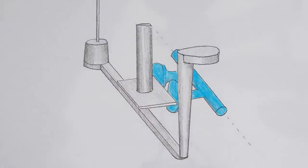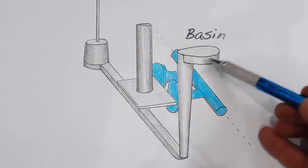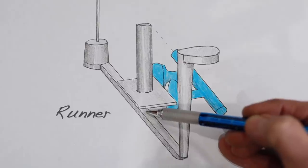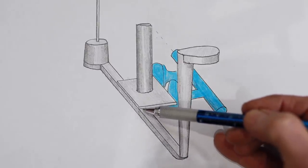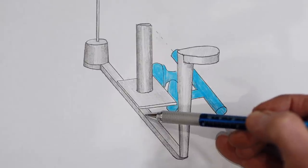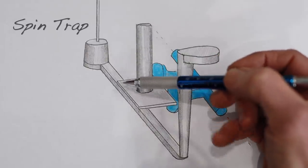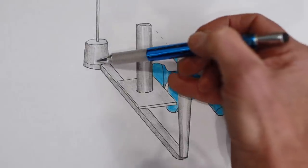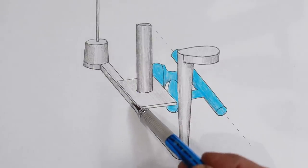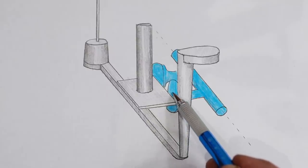Here's a diagram of what our mold is going to look like. This is the sprue, and this part is the basin — we'll talk about that shortly. The metal starts at the basin, comes down the sprue, and then goes across a runner. The velocity at this point is fairly quick. Professor Campbell's solution is what he calls a vortex gate, or spin trap: the metal runs in, spins, and slows its velocity. Once the vortex fills, the metal runs up into the gate — the flat piece — and enters the part.